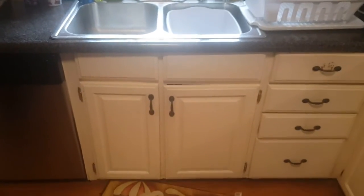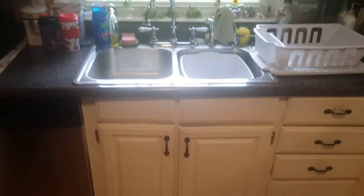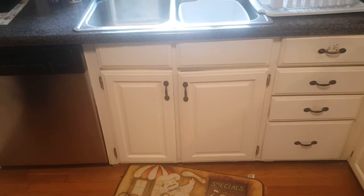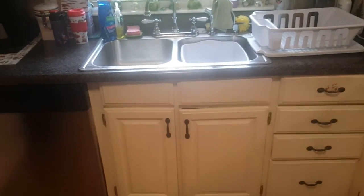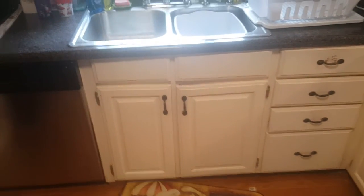If you take a look, the sink base on this is only a 30-inch sink base, 33-inch sink, so it's actually much smaller. We can still do a sink base 30 on this layout if we saddle cut the sides and bring that in. Customers talking about doing an undermount sink on this layout. So an undermount sink is only a 31 flange, 30-inch bowl. So that would work if we wanted to do a smaller sink base.